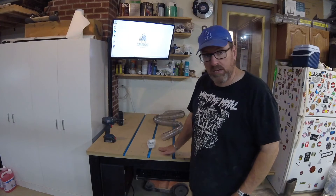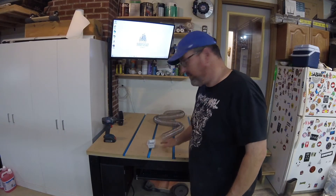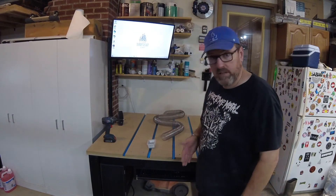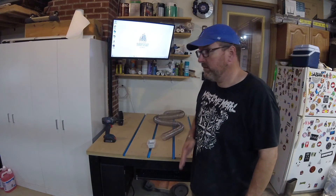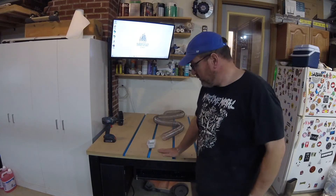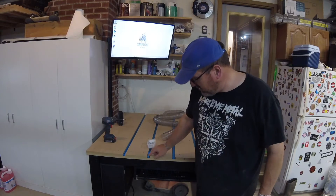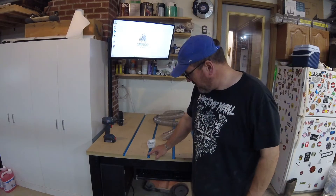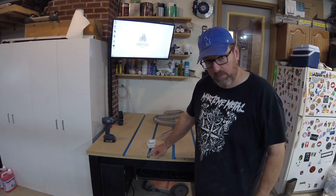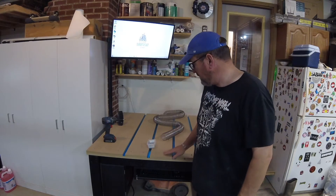As time goes on and these boards take a beating, I just pull the 8-10 screws, throw that piece out, replace all three spoil boards, and resurface the whole area again — back to work. The T-track is only put in at half depth, so I've got plenty of room; I should be able to surface these a couple of times at a millimeter each time without any issues. So short of having the mill, I think I'm basically ready to go.